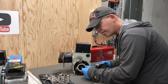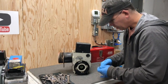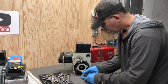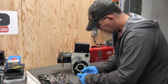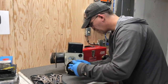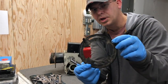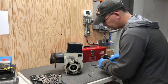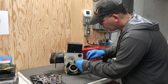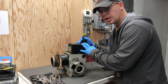Now this here is the shutter — there are two 5/16 screws. Then you've got the band with a 5/16 screw; you can just loosen that up and slide it off. Now let's go ahead and open up the ignition transformer.